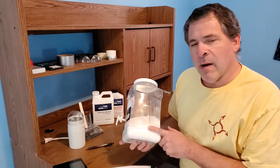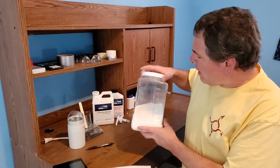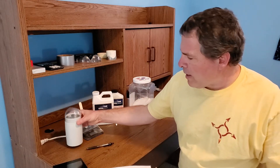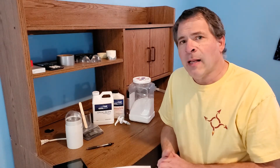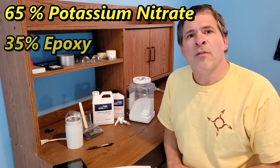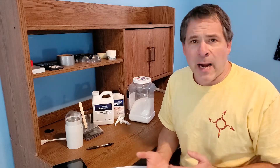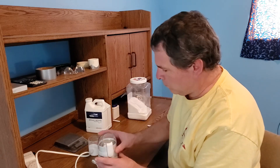Before we mix up the epoxy we need to prepare our potassium nitrate. I already buy it in a powdered form, but it's kind of a rough powder — kind of like table salt or white sugar. For this particular experiment we're going to need something a little bit finer, so I'm going to use my coffee grinder to grind it into a very fine powder, much more like flour. I don't know exactly how much we'll need until we mix the resin and hardener, but we're going to need 65% potassium nitrate and 35% epoxy. According to Dan's documentation we'll probably need somewhere between 80 to 90 grams, so I'm going to grind up about 150 grams so we have more than enough.